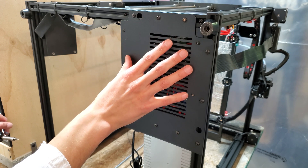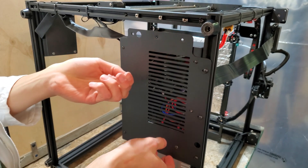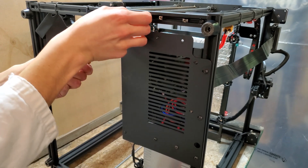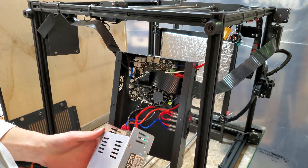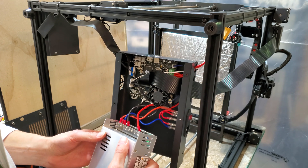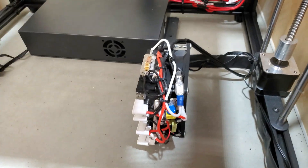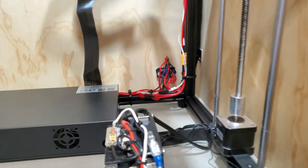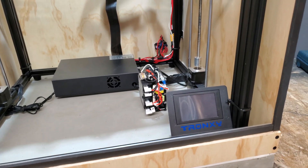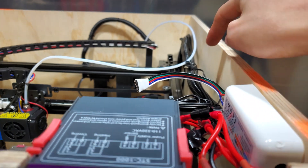One of the major issues with making a printer enclosure is thermals. The driver board of the printer isn't very sensitive to heat, but the power supply definitely is. In my printer, as with most printers, the two are packaged together. I will be separating them and locating the power supply outside the enclosure in a much colder environment. I won't be covering the rewiring in super specific detail, but I will quickly go over it. I went and cleaned up that heater a little bit and adhesived it down to the concrete. I cleaned up all the wires on the printer mostly. In the back I went and installed all the wires, and we have two main sets of cables coming through this black conduit plus the heater wire.